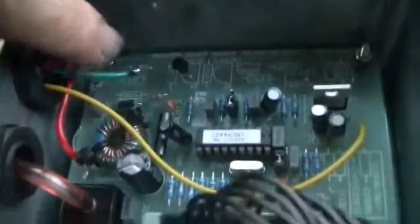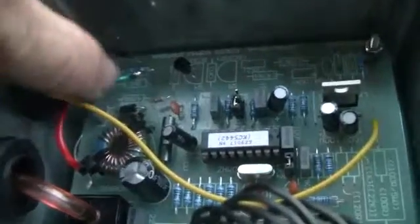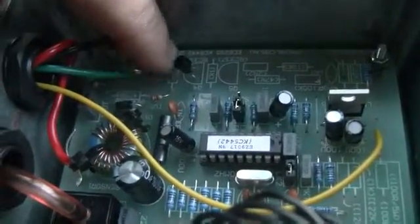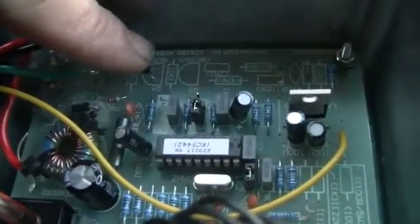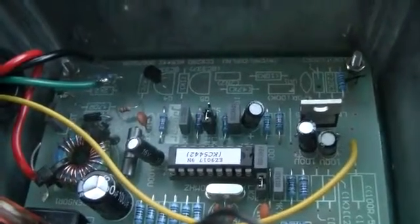Here's what I did - at first I thought I had no ground on the black wire, but it is grounded out there. This is my key wire for the ignition system - the capacitor discharge ignition. There was a 1k or 100 ohm resistor in series with that. That thing draws 300 milliamps - this transistor can't handle it. I'll put a FET in it but this might work, we'll see.